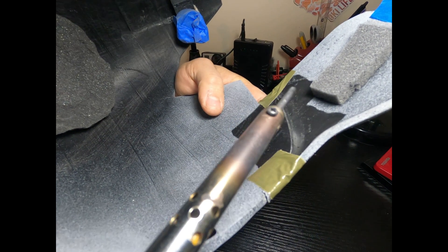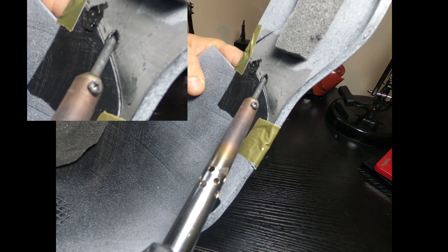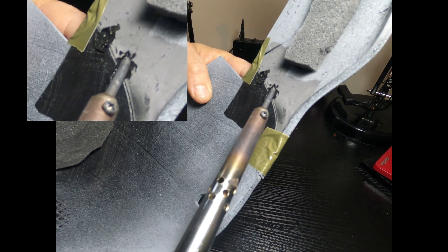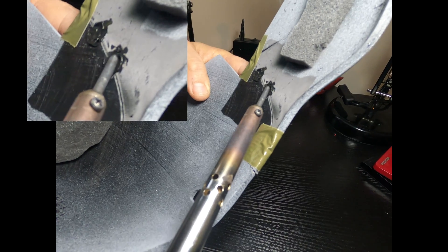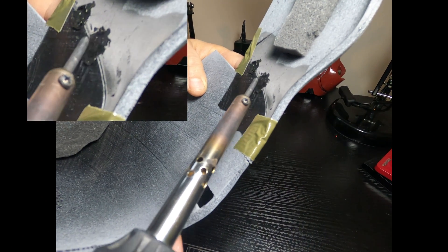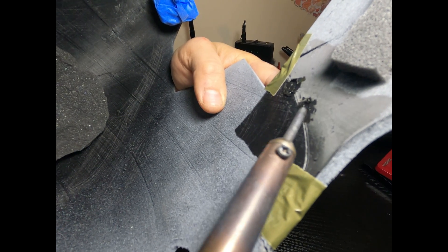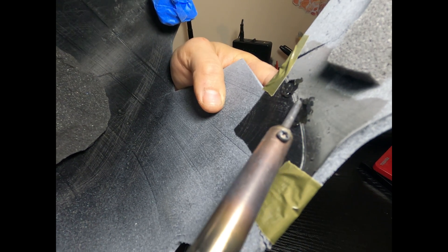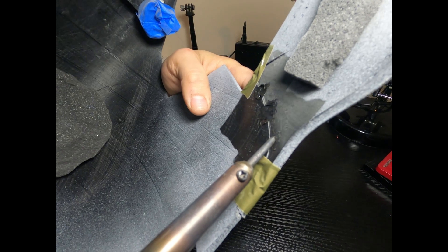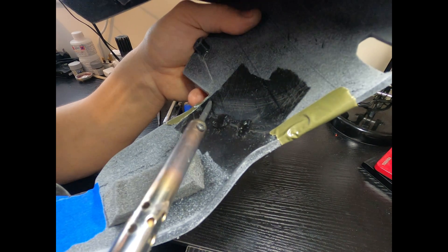I currently don't have any flat open parts to really show you — I should have printed some for this, but since this was what I needed to do I figured this would be the best video. Just make an X-cross right along the seam and it'll melt the plastic together. You can already see some smoke coming up, so please avoid breathing it in. If you used superglue, when you hit those pockets of dried glue it will vaporize — do not breathe that in or let it get in your eyes. It's bad.